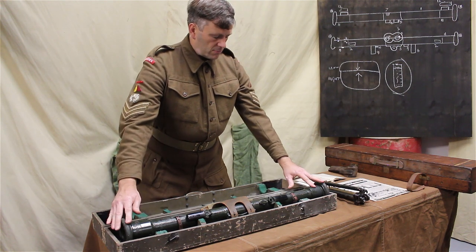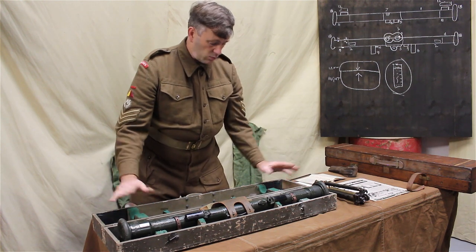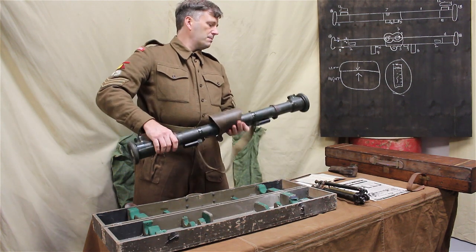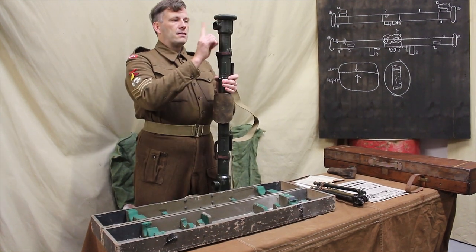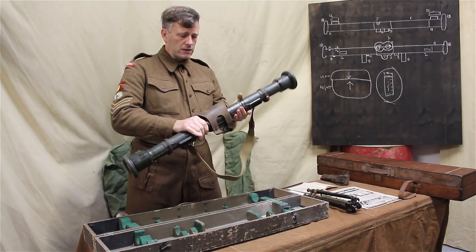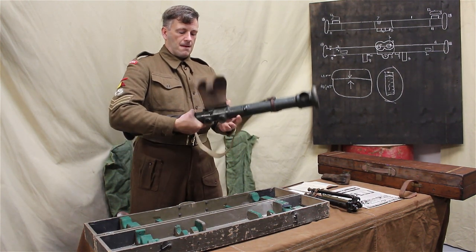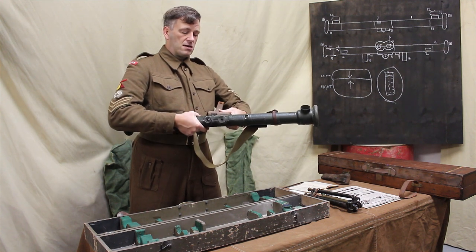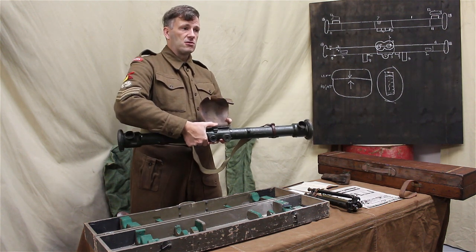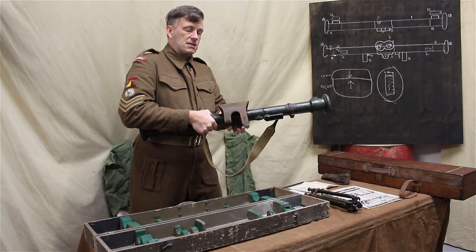The instrument, as you can see, is fitted into the box. It can sometimes be quite a tight fit. This one isn't, because it's been used many times for training. To fit it into the box, you must have the end pieces turned upwards, the handles folded, and the centerpiece turned as far away from the eyepieces as possible, towards the back of the instrument, towards that front window. So as we showed you, this rolls round. This centre face needs to be turned all the way around to the back.